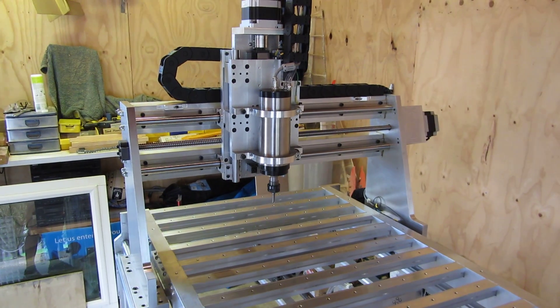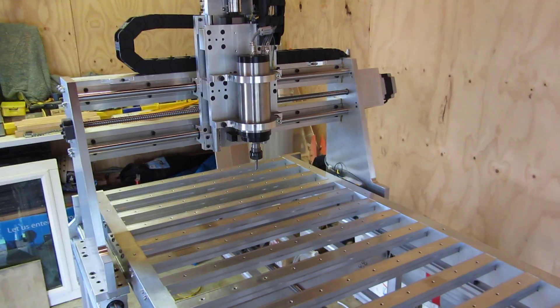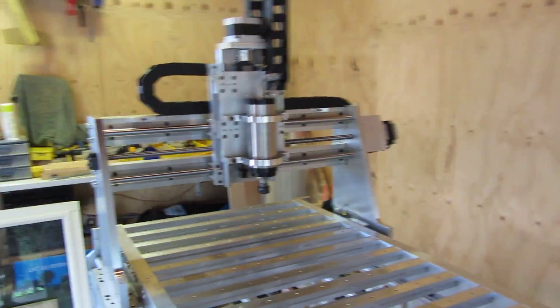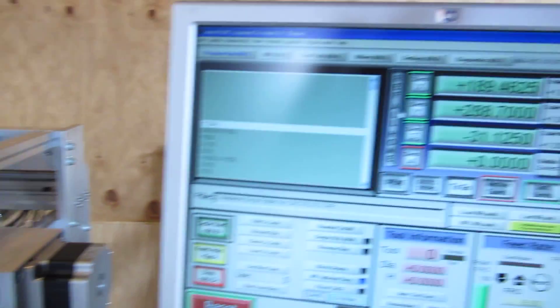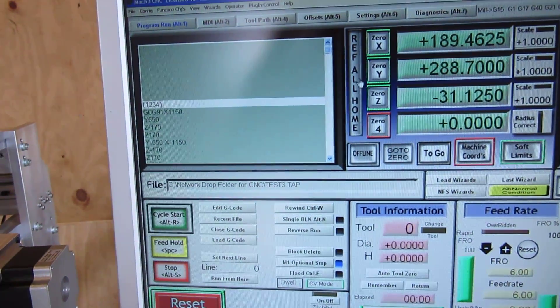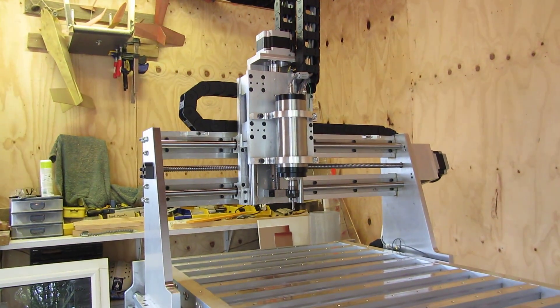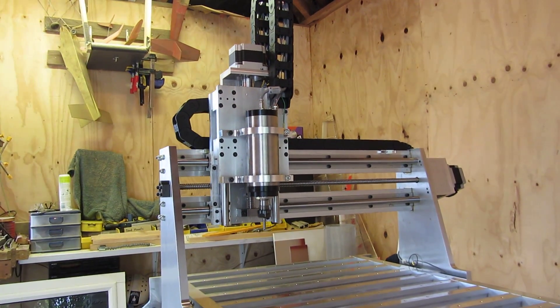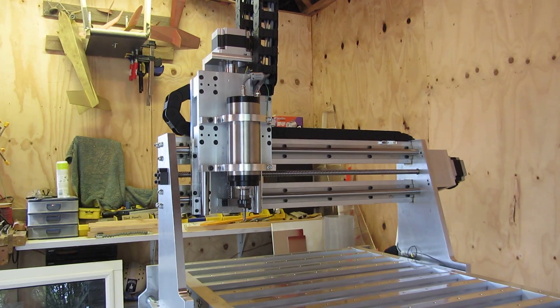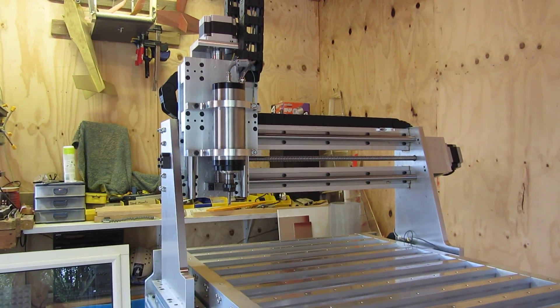My rapid is only three meters — cheap motors. It all does what it should do, and when I hit the home button you go reference all, then it references home. Although my initial tests with homing went up to the switch and then backed up, this just goes up to the switch and stops. I'm not sure why.